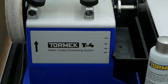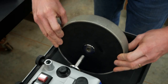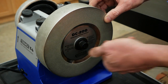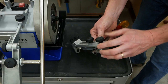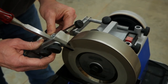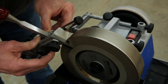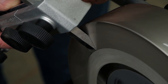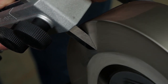To sharpen my chisels, I'm using a Tormek T4 sharpener equipped with Tormek's coarse and fine diamond wheels. These diamond wheels let you sharpen the flat top bevel of mortising and bench chisels on the side of the wheel using the MB-100 multi-base attachment. Side grinding like this isn't safe with ordinary aluminum oxide grinding wheels on a high speed grinder because the wheel can shatter. But on these wheels, the diamonds are anchored with nickel to a steel core that runs perfectly true — no danger of fracturing or shattering. Tormek's slow speed wet sharpening action keeps the tool steel cool, so there's no risk of the cutting edge losing its temper.